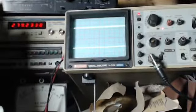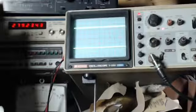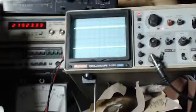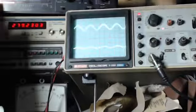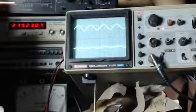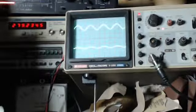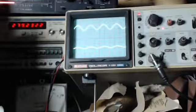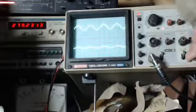First of all, when that bar graph drops the whole range, that's 30 decibels right off the bat. So we already know that the signal is more than 30 decibels weaker. I'm going to amplify the gain of the scope right now. Bingo. I've just added another 20 dB. Wow. I've just added another 20 dB, and now we can see the signal. Yeah, let's do this. That's better.